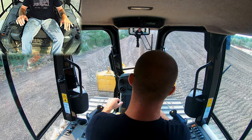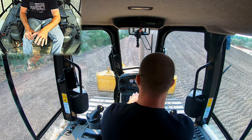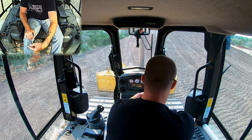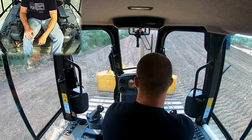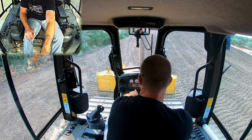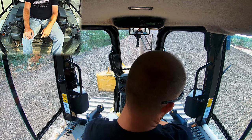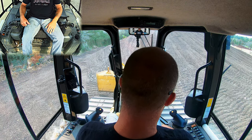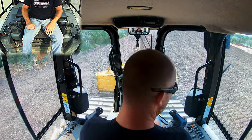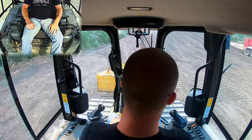So I'm going to do that on this dozer. I go into my menus — you guys can't see this; don't worry about it because it's different for every dozer, you'll just have to explore the menus. When I flip this over, you're immediately going to hear the engine go full bore. There we go — we're now full bore. So now if I go in reverse with my decelerator — which is no longer a decelerator — with it pushed to the floor we don't move, but if I start letting off, I'm only controlling track speed now, not engine RPM.